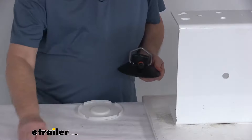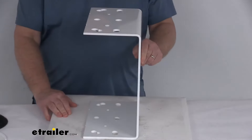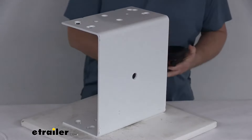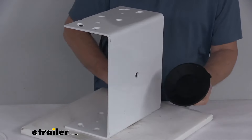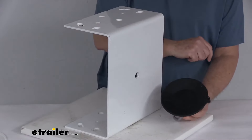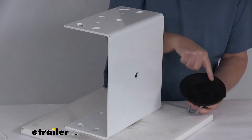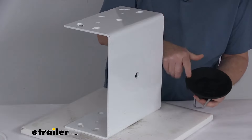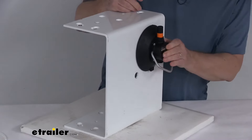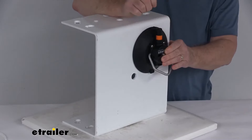I'm going to slide this metal piece here — it's a pretty heavy steel part — so we can show you how this mount would work. Basically, when you go to install this, you'll clean the mounting surface and also make sure you clean the face of the cup so there's no dirt on it. They recommend — and they even stamp it on here — to moisten the sealing edge of the cup. So I'm just going to wet my finger and put it all the way around there. You want to install it where you can see this orange band, because that's going to show you the suction that's on there.